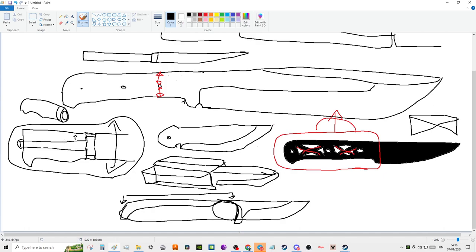And the nice thing is, if you don't put any glue in this, and you get a split in the handle or you got an issue somewhere, you can always shave this off here, pull the handle off, then put a new handle on that's slightly shorter, peen it again. So it's very easy to change handles on through tangs. And you see this a lot with ancient swords. The old swords of the past, the peak of sword making, are super interesting because you have the through tang like this.